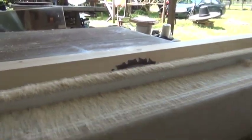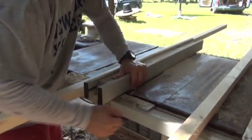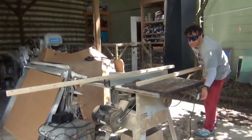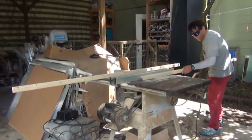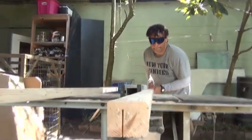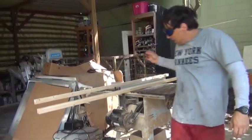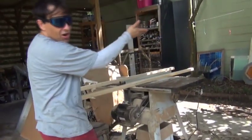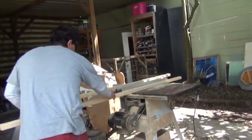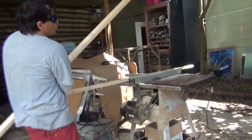You want your saw blade to leave about a quarter of an inch to 5 sixteenths away from the top. We're going to move our guide back in — just to show you. So we are at 5 eighths here. I'm going to lock it down. I'm letting the wood go again — it's a lot safer than putting your hands close. Just make sure there's no wood spears or anything. We need to do this process twice.